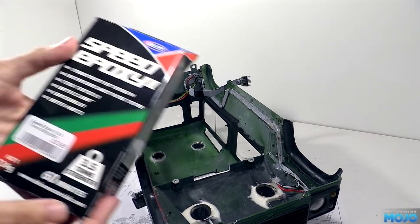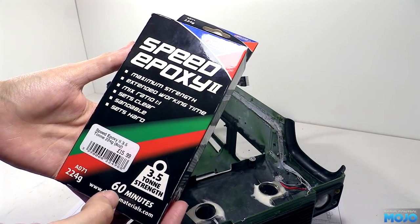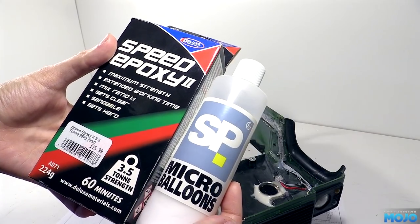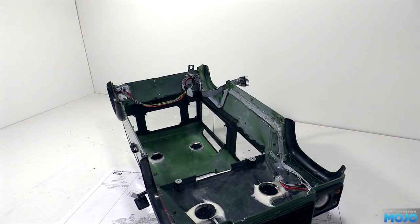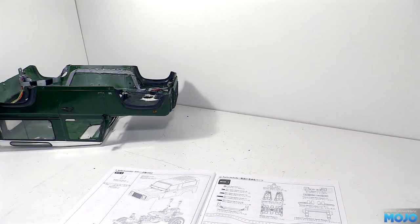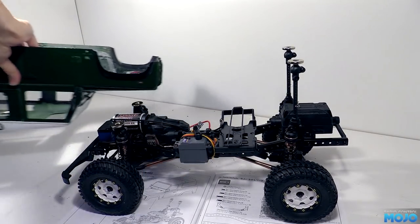For glue I used some good quality 60 minute epoxy so I had plenty of time to adjust things. I mixed in some micro balloons to turn the fairly thin epoxy into more of a paste, making it much easier to handle. You can just about see that the glue around the front cups has a bit of an odd shape — that's because the bonnet isn't flat and the cups were half sat on a bit of a shelf. To make sure the glue filled the void I used a bit of blue tack to make a dam. Once the glue had hardened the cup was fully supported.